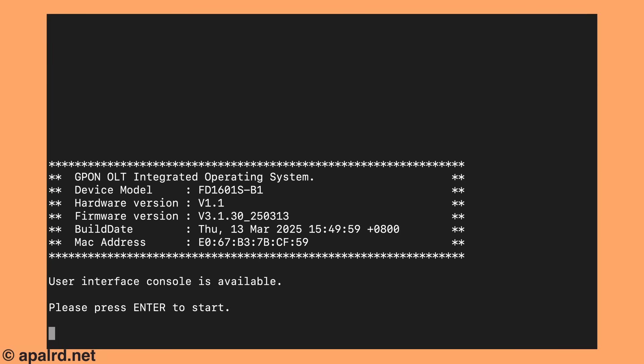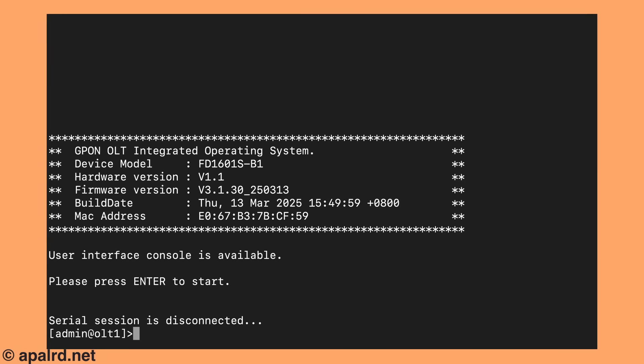This is as simple as it gets. This thing has some operating system on it, it can speak SSH on port 22. You log in, you tell it 'serial connect', and it connects you right through to the serial port. You hit Control plus bracket to get out of that and you're back to its console. Now they say they're working on a firmware version that uses two different ports — one to connect directly to the serial, and one for the admin interface. That doesn't seem like a big problem; if you're doing remote access stuff manually, it's not a big deal.